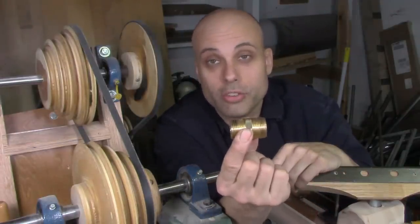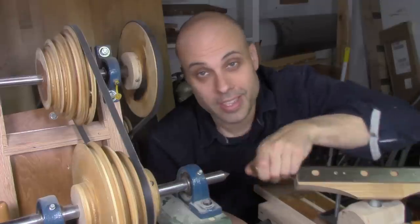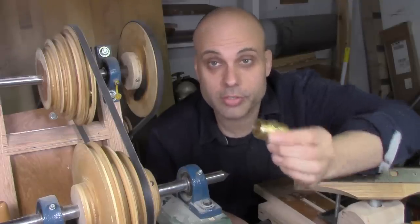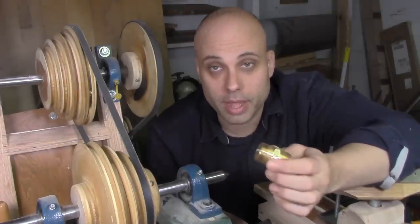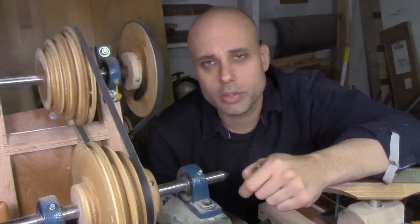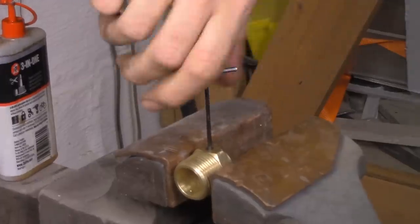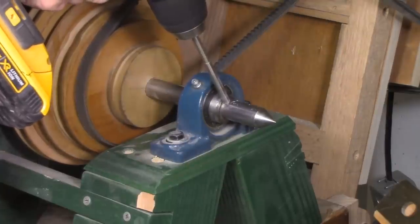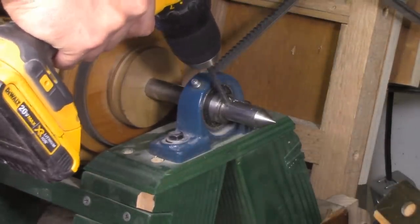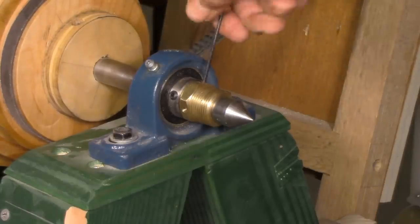This is a three-quarter-inch threaded hose coupler — it slides on there like butter. This is going to solve my tool mounting problems. It's threaded on both ends, and I don't need threads on the back end, so I'm going to cut them off. It's brass, so it works pretty easily. Then I want to secure it really tightly to the shaft with set screws. I'll drill and tap three of the flats in the middle of the fitting and add 10-24 set screws. I'll mark their location on the spindle and drill some holes a little bit bigger than the set screws — that lets the screws reach inside the shaft to bite down better and keeps them flush with the exterior, so I can still put a wrench on it. Once installed, I'll effectively have a threaded spindle nose.